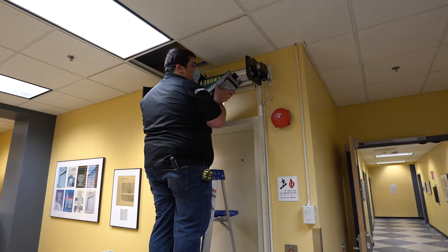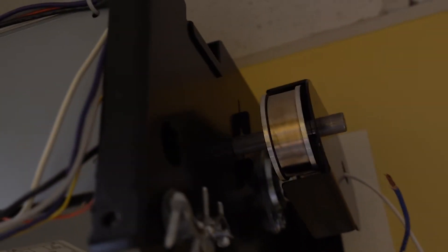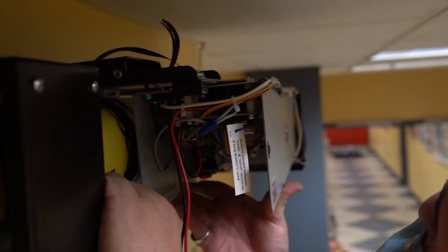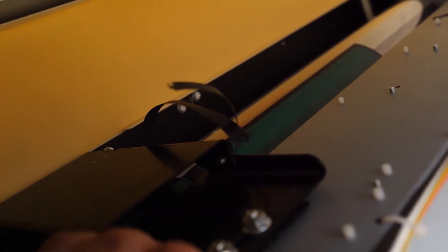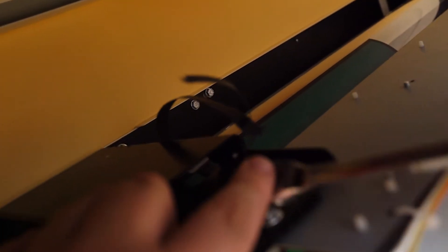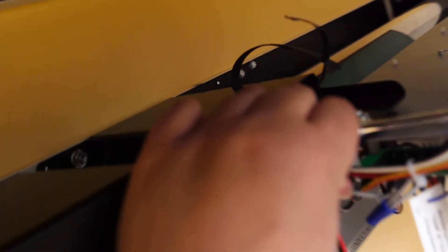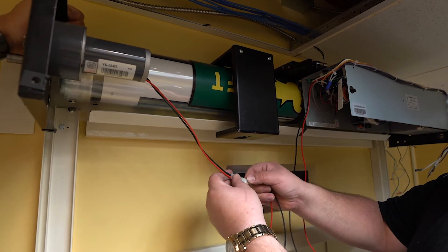Now it is time to install the control box inside the head box. You will start by installing the control box onto the right hand bracket by inserting the J clip and upper bracket clip into the slots. Then lift the opposite end of the control box to the support bracket and insert the downward facing stud through the keyhole on the control box. Next, slide the tab so the nut can be tightened on the narrow section of the keyhole and tighten the quarter inch 20 fasteners on the upper side of the support bracket. Once that is attached, it's time to make two electrical connections — first you will wire the motor. Secure any loose wires using the provided cable ties.